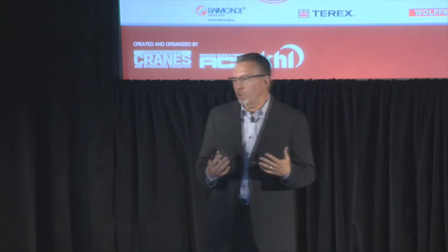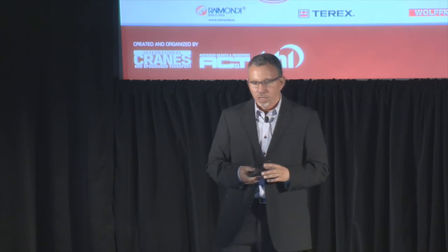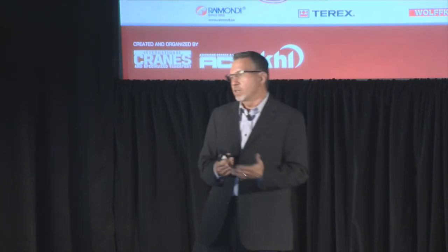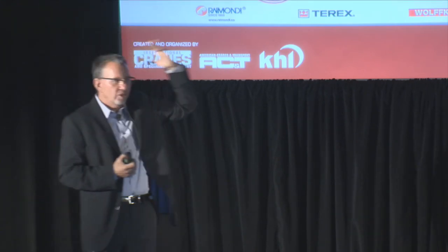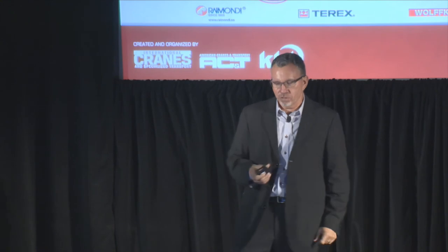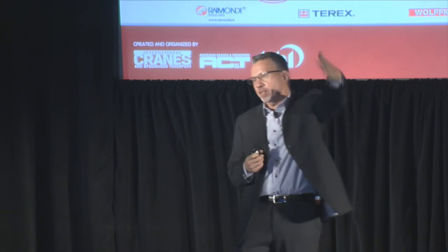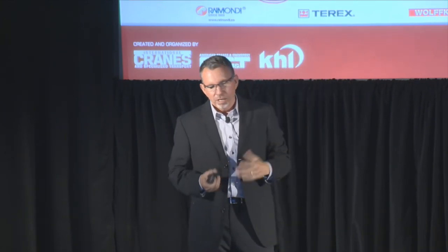A couple of quick disadvantages: they're definitely more difficult to move on site than a mobile crane, since they don't have a chassis and take several hours to fold up and relocate. They're more expensive to purchase than a small tower crane of equivalent size due to the complexity of linkages, hydraulics, cables, and pulleys. Compared to tower cranes, they have limited capacity and reach — they can't go 600 feet tall or reach out 80 meters. And the sophistication of folding from 150 feet tall down to semi-truck size adds mechanical complexity.